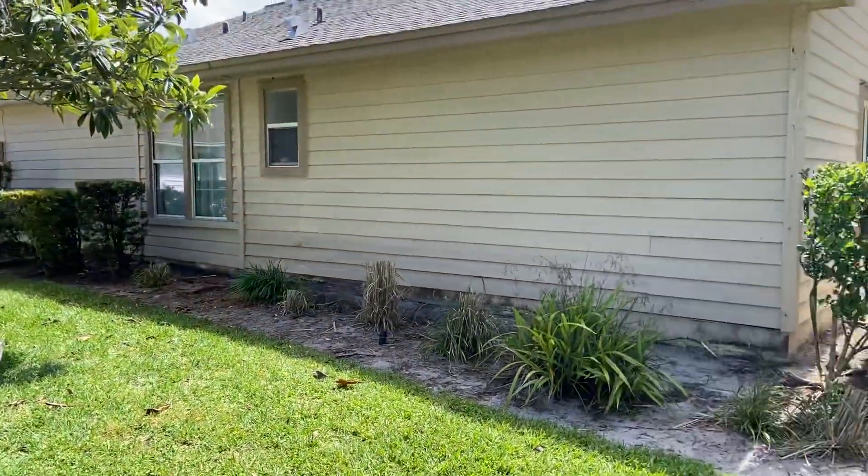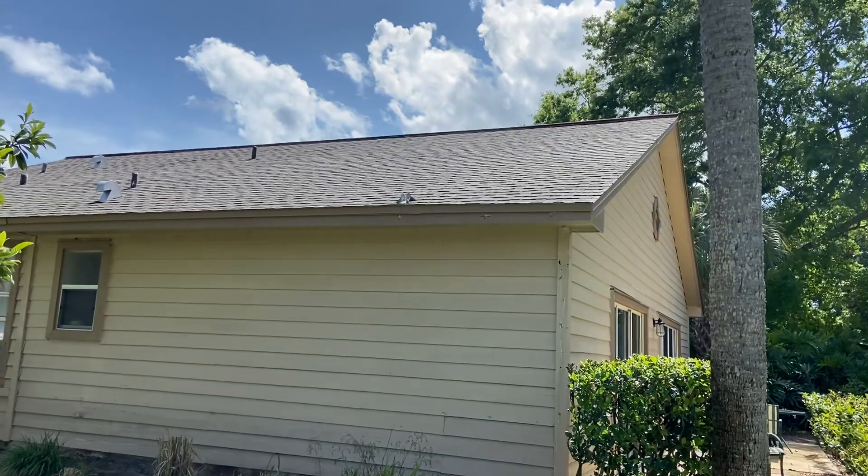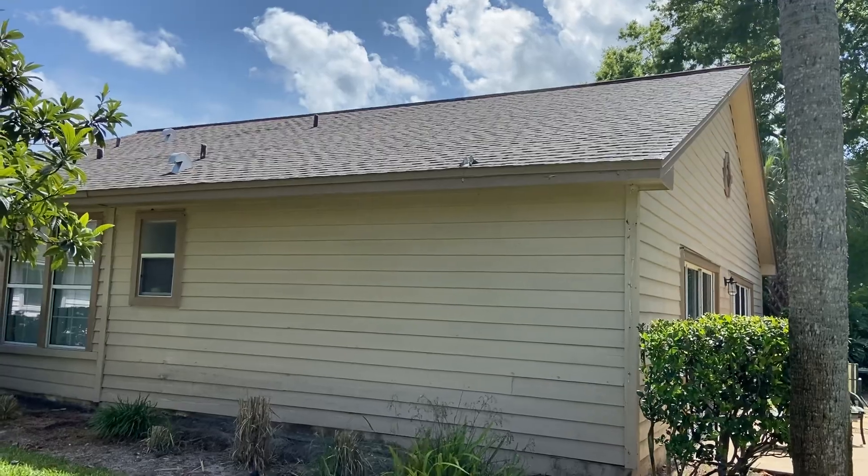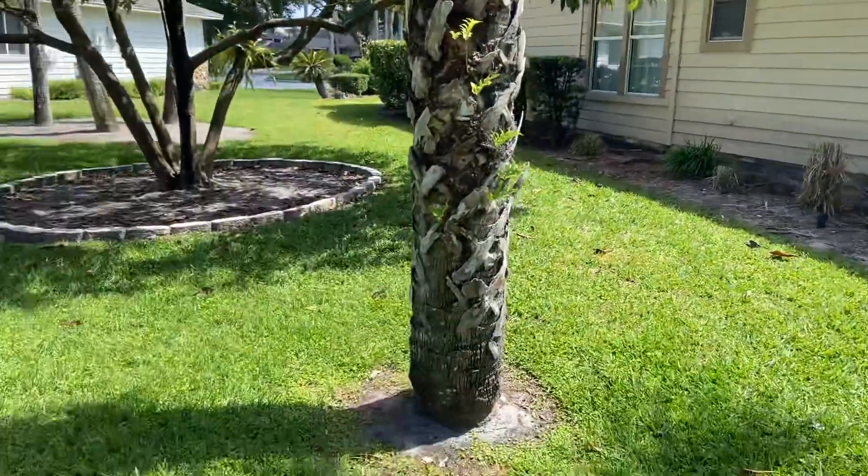I came back about a week later to do some gutter repair and the roof looked amazing — looked like a brand new roof. I can understand you guys who just go out and spray solution and walk; I used to call that my blow-and-go. This roof came out really pretty, but the roof is super old so it won't look brand new — it needs a tear-down soon. When I got up there I saw all the limestone granules already missing, big black bare spots, and granules in the gutter track, so I flushed the gutters out with my solution and made sure the downspouts were functioning properly.